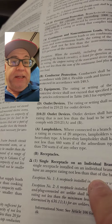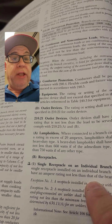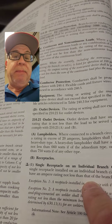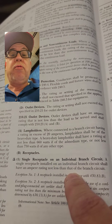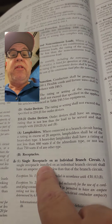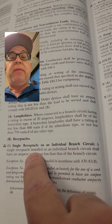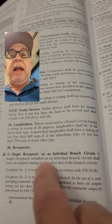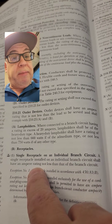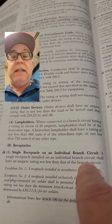If I told you it was a 50 amp rated receptacle, but asked: could you put a 40 amp branch circuit on that 50 amp rated receptacle? Many people will say no, but the fact is you can. The rule says: a single receptacle installed on an individual branch circuit shall have an ampacity — that is, the receptacle shall have the ampacity rating — not less than that of the branch circuit.